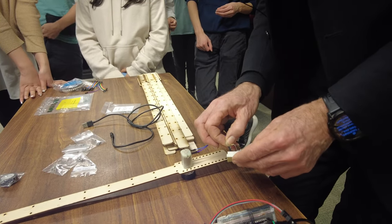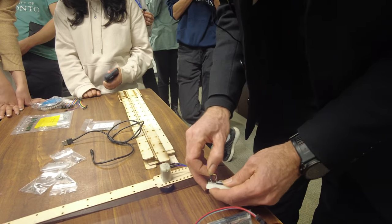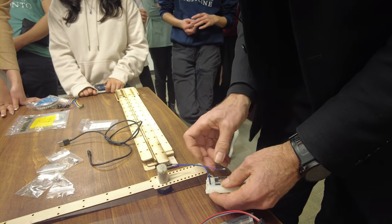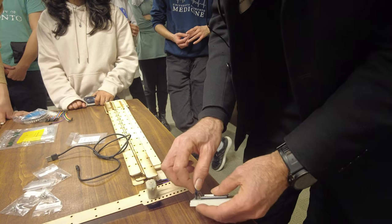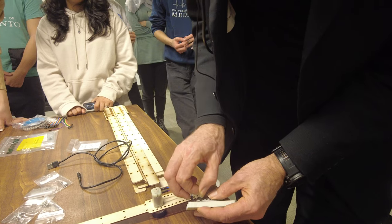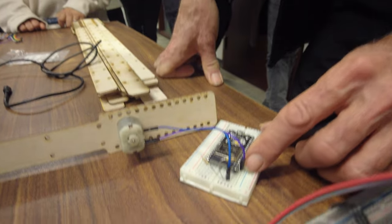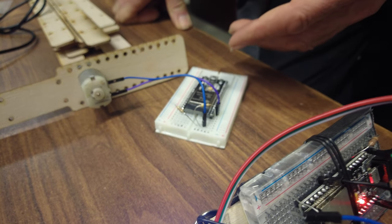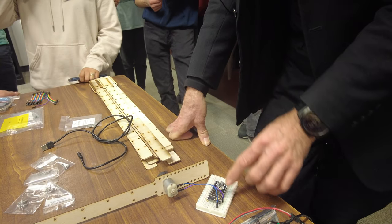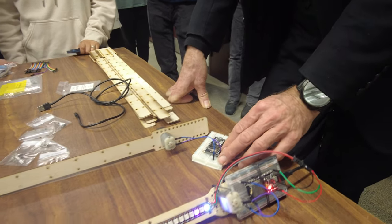Take the blue wire — that will be the virtual ground, halfway between ground and plus 5 volts, the reference end of the motor. The purple violet wire, color seven, goes to three pins from the end, which is the analog input. Remember you have four analog inputs you can use without conflicting with Bluetooth or Wi-Fi. The best ones to use are the upper-left four.